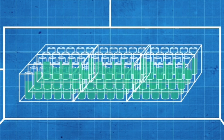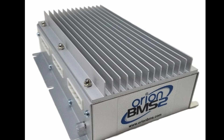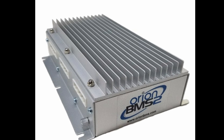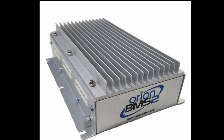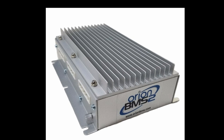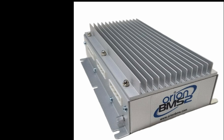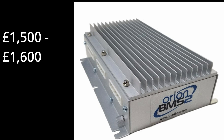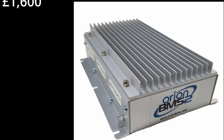What are the BMS options available for a DIY builder like me? The Orion BMS is probably the most used and most professional one out there in the marketplace. It has lots of features — state of charge calculation, cell over-voltage and under-voltage protection, intelligent battery balancing, battery charger control, pack temperature monitoring, and monitoring the health of the battery pack. I think I will not go for this option because, while it's probably the most professional, it is also the most expensive one.